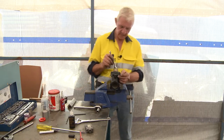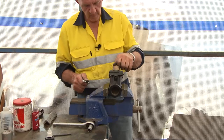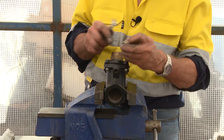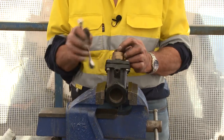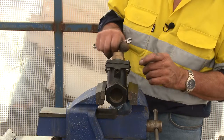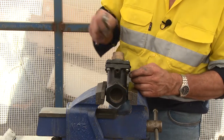You can see here we've got a big brass nut and on the top of it we have a breather. That breather needs to be clean and blown out. I would do that before I pull this valve out and before I start checking the diaphragm, because it could just be a dirty gauze breather preventing it from exhausting the spent air on this side of the diaphragm.